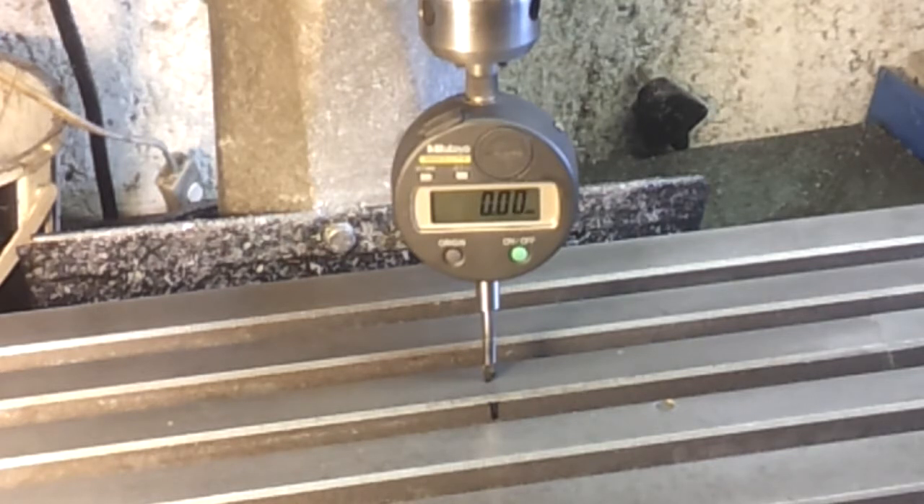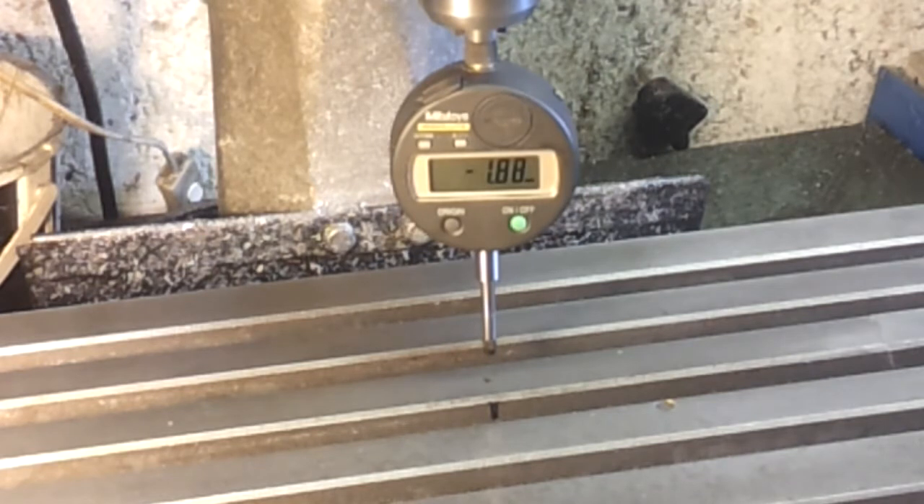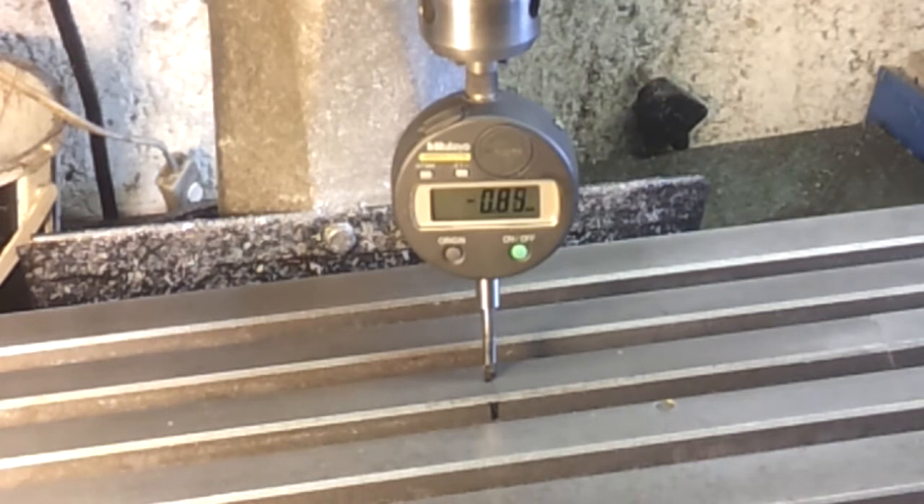It's occasionally missing a step, but it is going back to zero. That should be 10 and it's saying 9 — could just be a rounding error. It should be 20 and that's saying 20. Taking it up a bit and back down again: that should be zero and it is. So it's consistent, and it's about 10 micron accuracy.